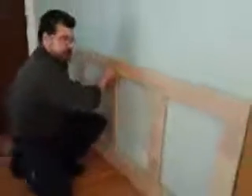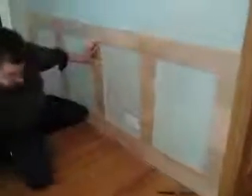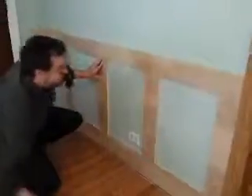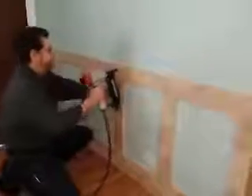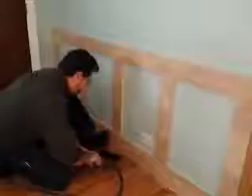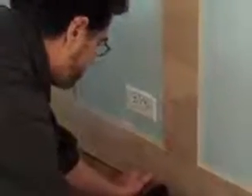As you can see, I do have a tile down over here for levelness for the floor. We've got to have everything level. I did mark the studs, so we're all set with this 16-gauge nailer. I marked the top and bottom for studs so I have something to nail to — you don't want to go through just drywall.